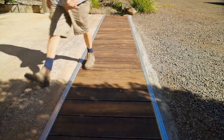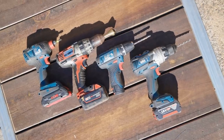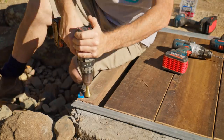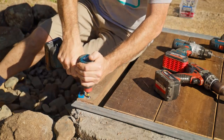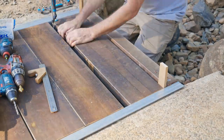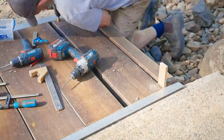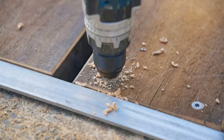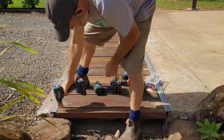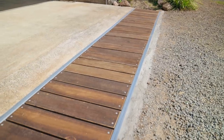That's looking pretty good. I've got these thinner pieces that I cut off camera and I'll fix those to either end of the gutter. I've got three drills in a driver setup ready to go — the first one pre-drills all the way through the wood and the metal, the next one widens the hole in just the wood for the screw to pass through, and the third drill is for countersinking. I'm using batten screws to fix the sleepers down. We won't be coating the sleepers — no finish works well on exposed timbers lying flat in our weather conditions, so I'll let it weather and go grey. If I were to use anything I'd use decking oil, but that needs reapplying at least twice a year and it quickly gets oversaturated and becomes soft and sticky.